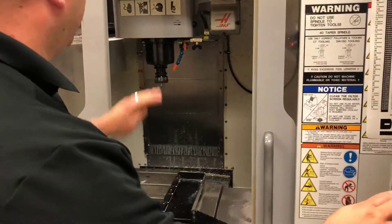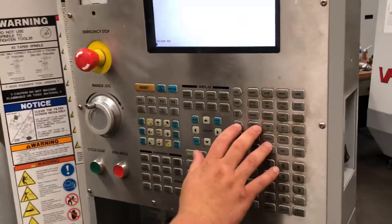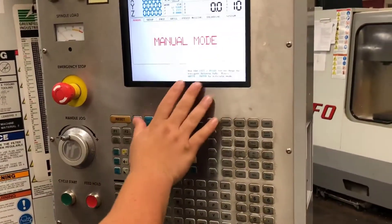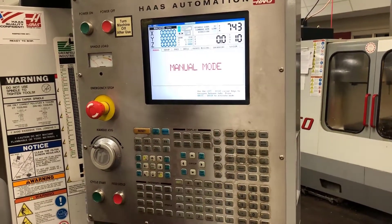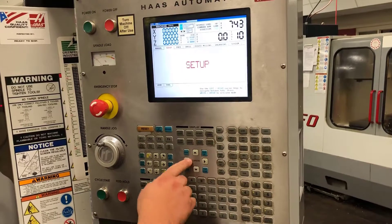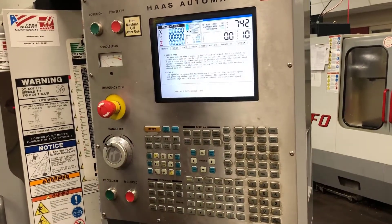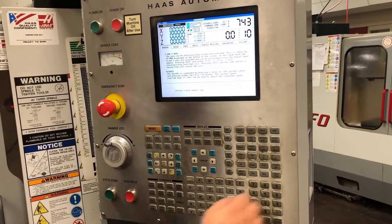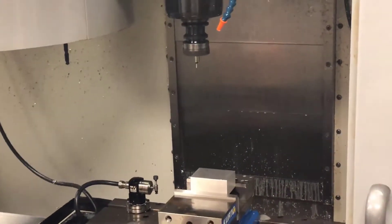When I open up my door, you'll notice that my RPMs have gone down — this is the safety feature. But for the purposes of this video, I'm actually going to have the doors open so you can see what's going on. I will come up into my hand jog. Some of these screens are going to vary — some older models will not have it, some newer models will not have this style. To get out of my manual mode, I'll hit cancel, come over to manual again, and hit enter. I'm going to put it into the X axis, increase my increments to about 10,000 so I'm not going to spend all day getting over there. I am coming to the bottom left corner of my part.